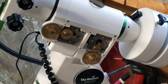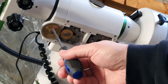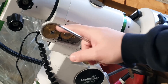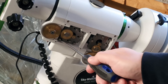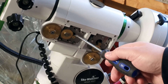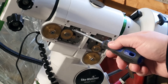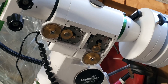Then you take a flat and push it towards the worm drive gear ever so slightly, then check to see if you have backlash, and also check that you don't have binding between those two gears. When that is in the correct position, you tighten these three screws, and then you adjust it once more to move the stepper motor gear against the middle transfer gear. When that is satisfactory you tighten the remaining three screws, and the whole assembly will hopefully be tightened with no backlash.